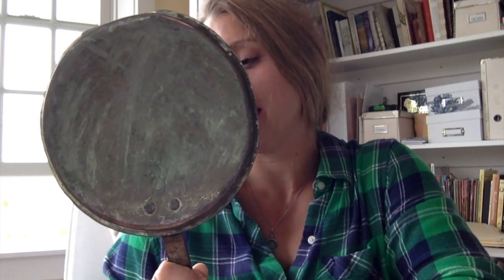This piece is very old — hand stamped or at least machine stamped, 11 inches. The tin is pretty much worn off and the whole thing is mostly verdigrised, or the tin is so old it's not doing its job anymore. I've been asked to fix it and also repair the top, which can be done using old tinner's stakes, anvils, and things like that. When the tin is this dark, it's not only dirty and oxidized, but it's no longer going to be non-stick.